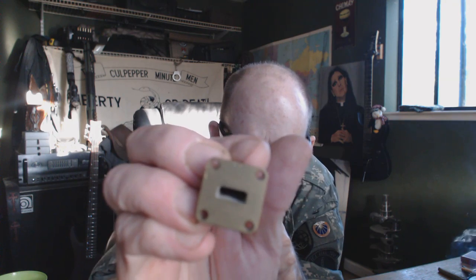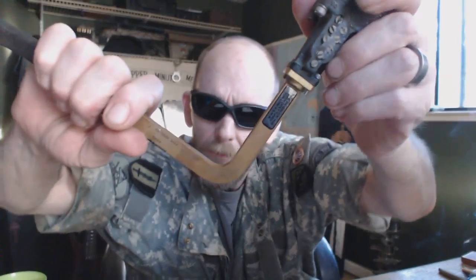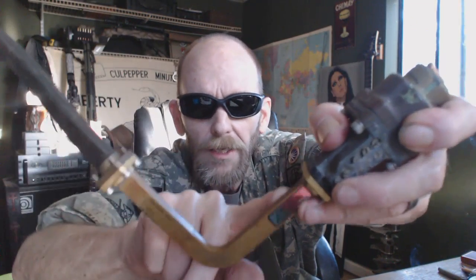The energy basically goes up to the feed horn in the antenna, gets blown onto the parabola, and then beamed out. The next part we have here is a piece of rigid waveguide — basically the same exact idea except you can't move it. This is a 90-degree section. When these pieces are made, they're put together and then swept, which is where you take a sweep generator — an RF generator that sweeps from one frequency to another — and look at it with a network analyzer.